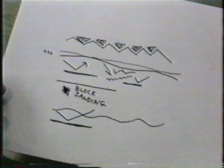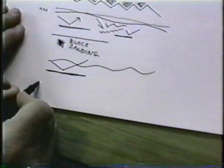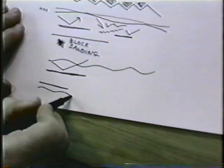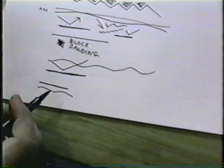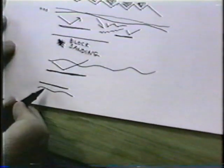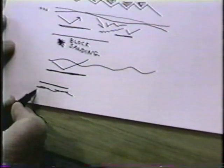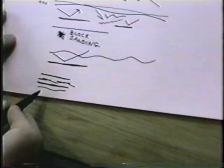Now here's what really happens with wood anyway. You sand wood perfectly flat with a block. You apply some dope and the wood does this. The wood swells, it gets wet and swells. If you don't believe it, take a piece of 16th and get it wet and you'll see it'll shrivel up, shrink, warp. Now once the dope is applied, you have to go back and knock down the mountaintops, fill in the valleys. You want to get it flat again. The second time it'll do it a little bit less.